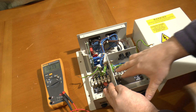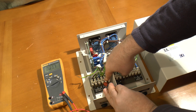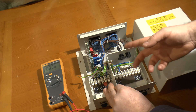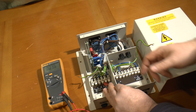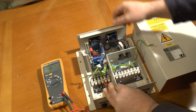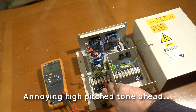If you did that during a power cut, your UPS is now back-feeding the mains. If that's connected to a step-up transformer — which it more than likely will be — that is now stepping up the mains to distribution voltage and could well be electrocuting an engineer working on the line. Trying to feed the rest of the neighbourhood isn't going to last long because the fuse will blow, but if there's an engineer on the line you've just given him an 11,000 volt kick and thrown him off the pole.